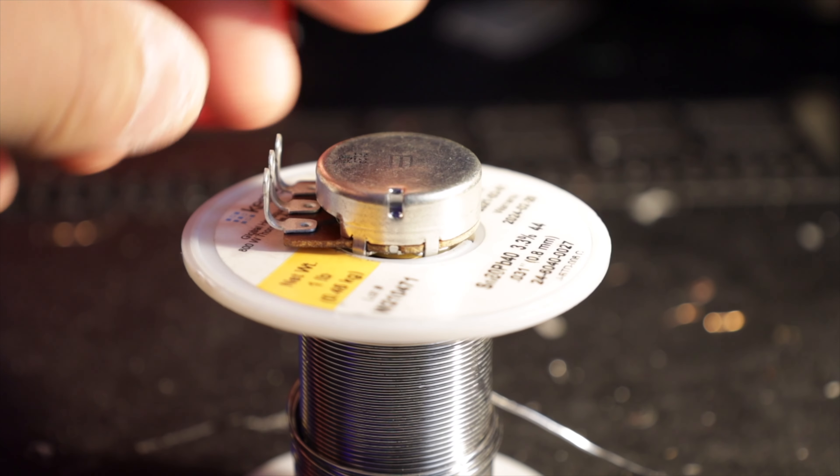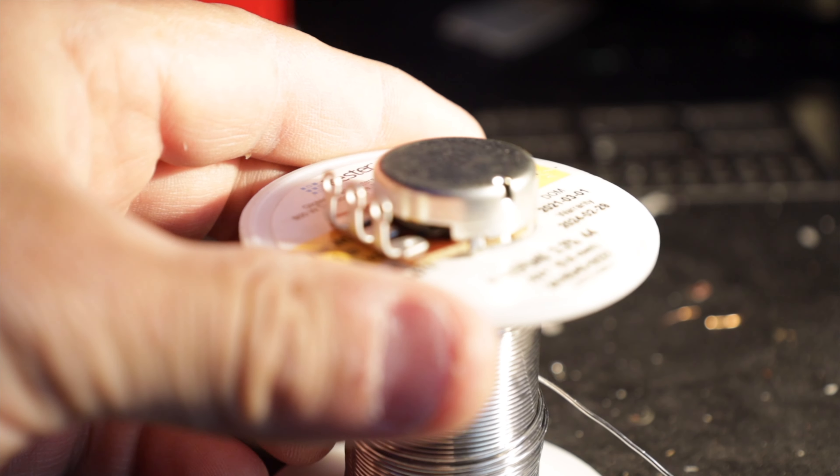It's a little bit harder with pots, so let me show you. Let's solder a cap to this pot. The biggest thing you need besides heat is to be able to hold your work. A cold solder happens when that chemical bond does not happen evenly all the way around the piece you're trying to solder, creating a microscopic crack. That can cause noise and ground issues in a guitar big time. The reason is typically you don't get the heat evenly around, and that can happen because your work moves.